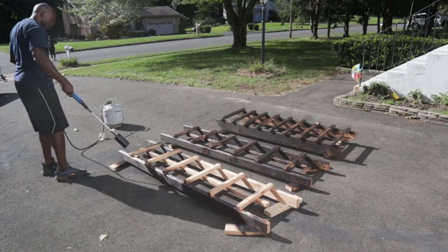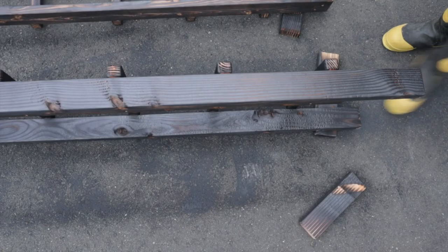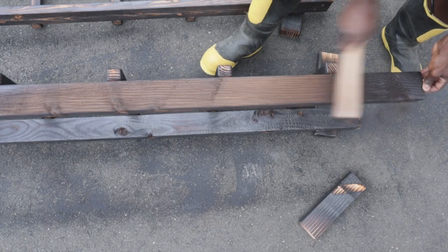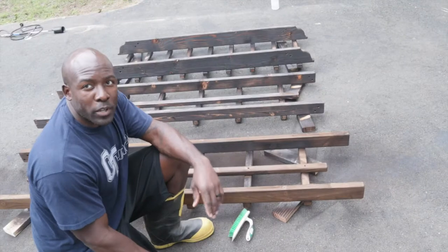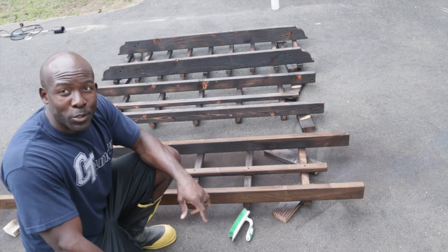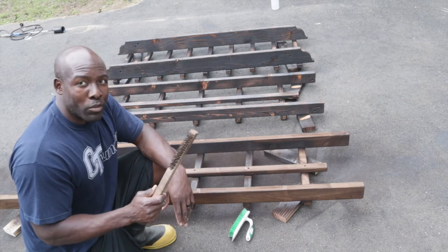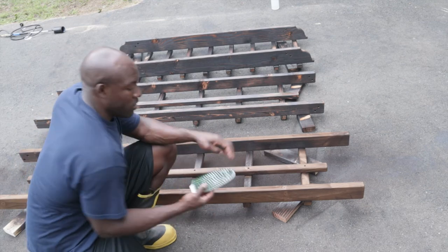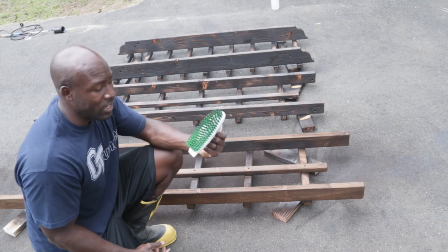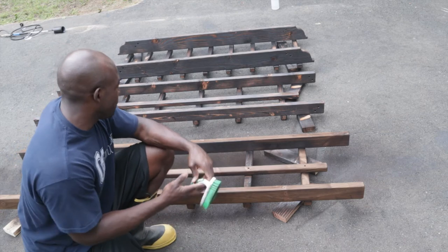After burning and cooling the wood, it's on to the cleaning process. Many sources recommend a wire bristle brush, so that's what I used. Two things I learned: one, this is super labor intensive — don't do it with a hand torch if you're doing a big project; get one of these flamethrowers like I used here. Two, ditch the wire brush — it takes forever and doesn't get in the grooves. Get one of these scrubbies instead. It gets in all the crevices really easily and it's not too abrasive on the wood. Those are my two tips so far.